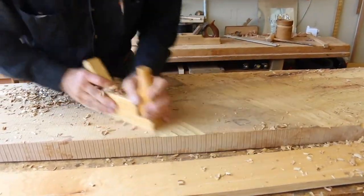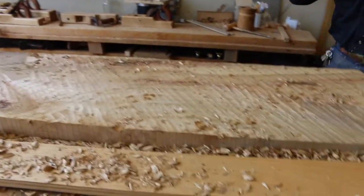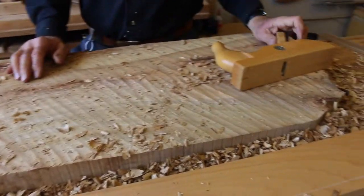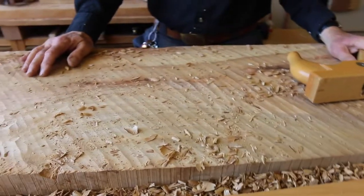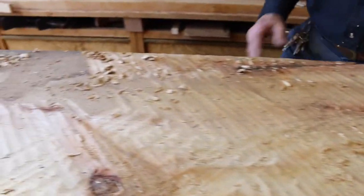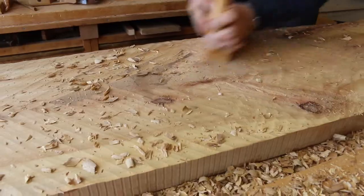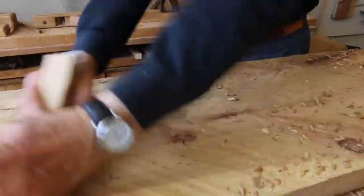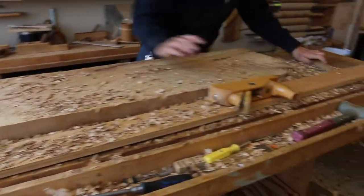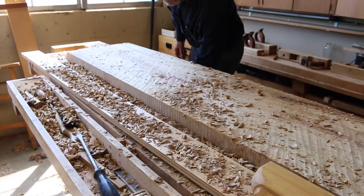This spot seems kind of high, so let's work it down. There are limitations of the short sole of the plane — there's some wobble along the length — but overall it's pretty straight. The smoothing plane will correct that, theoretically. A little wobbly down that edge, but I think we can deal with that on the next plane, which is longer.